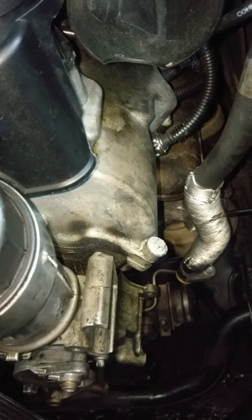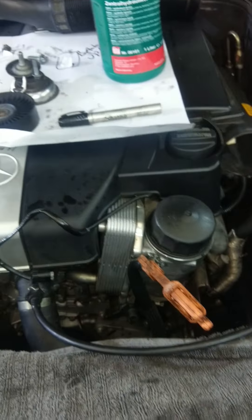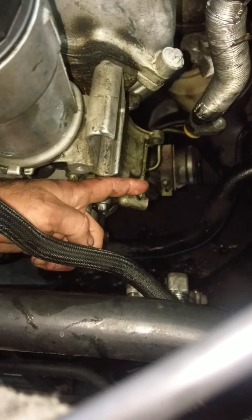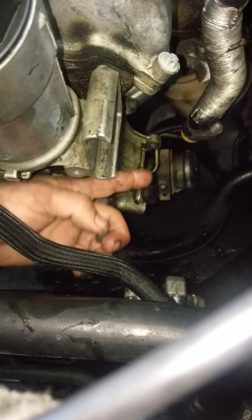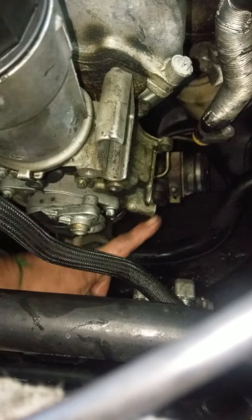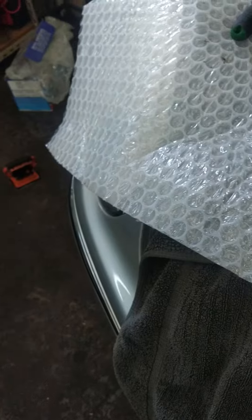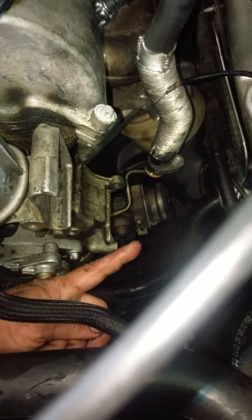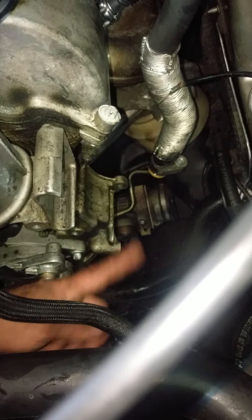Even when you're opening the compressor, the final point is to leave this one — crack it open and then just give it a close, so you've got the compressor sitting flush. Remove this bolt last. This bolt will come out only with the compressor — you can't get it out on its own, but when you move the compressor, those two bolts will come out with it. Once you've loosened the bottom two, then do the upper one.